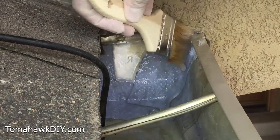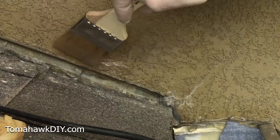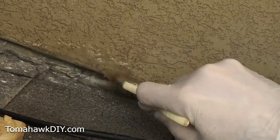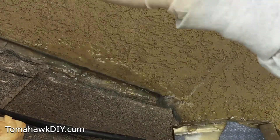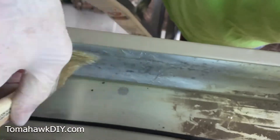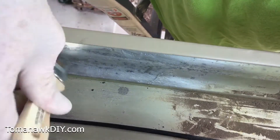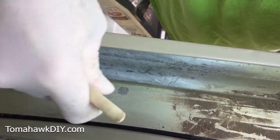We can come back and apply a second coat after one hour. I'm going to apply some here on the stucco and metal at this junction, just to be sure there aren't any leaks working their way through. The same principles apply — this has got to be clean and dry. I'm going to coat this gutter where there's corrosion pitting along it, applying a nice coat across it — heavy, but not so thick that it runs. It has great adhesion.